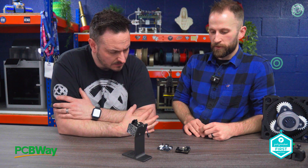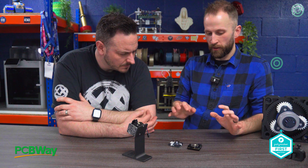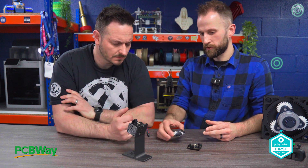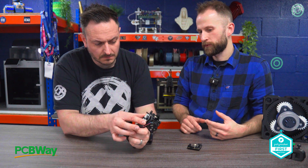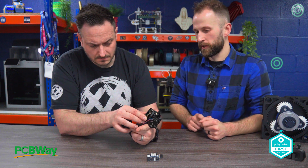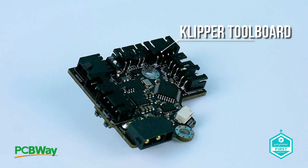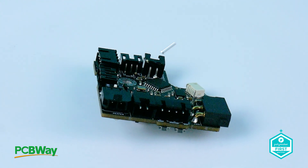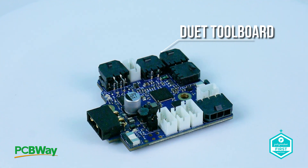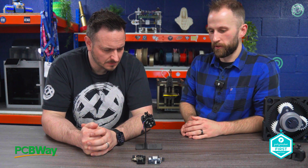So what are these boards here? These are two products we're really excited about, co-developed with LDO and with Duet 3D. These are specific tool boards designed to work and be implemented with Roto — they each have the mounting points to work with Roto. They're designed to take a signal from the main board; for the Duet one it's CAN, for example. Both have built-in accelerometers, so once everything is mounted, not only is your wiring a lot more simplified, but you can run your input shaping calculations with something that will actually remain on the print head — no more attaching an accelerometer and having to take it back off again.